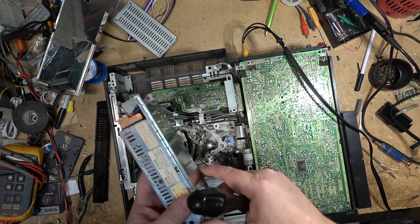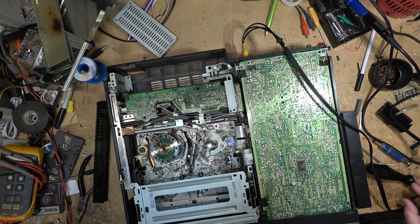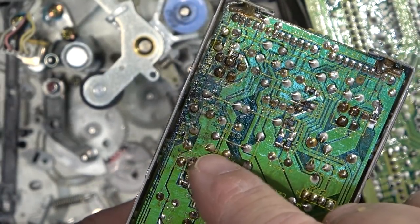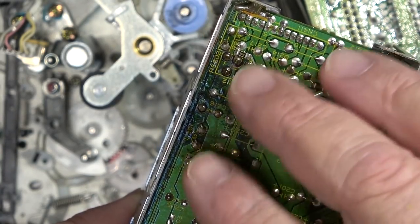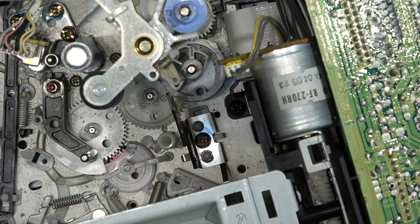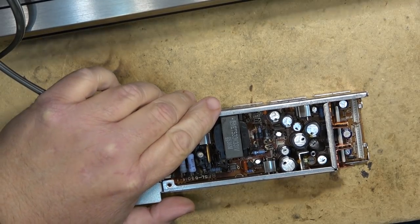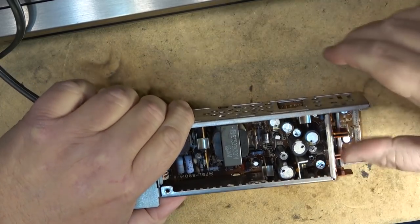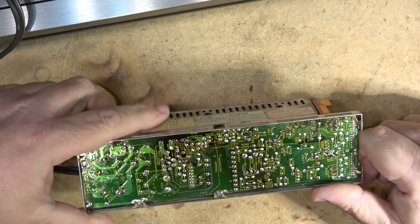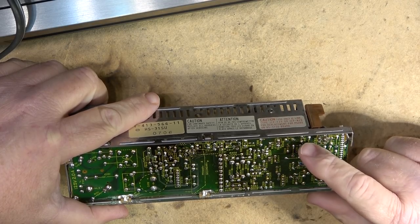These are going to be bad — you can see it has been hot. You can see where electrolytic has been leaking right in here, and you can see corrosion. There are going to be bad capacitors in this unit that need to be dealt with. There will probably be a handful that need to be changed — these look to be all originals. A couple caps down in here are going to be bad for sure: C216 is one and C220 should be another.